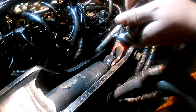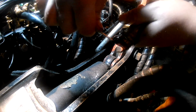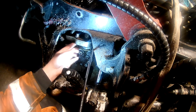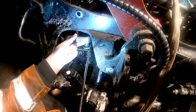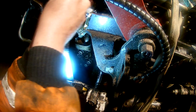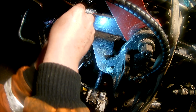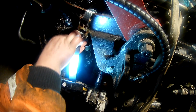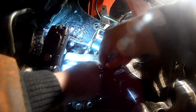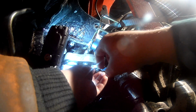Here are some of the blue seals that I replaced. These are quite expensive. The O-rings weren't that much in price. Here I hadn't cleaned well enough, so some time was spent trying to clean things up, and one of the pipes is not loosened at the other end, so I used the ratchet strap and kind of bent it up gently and removed the seal here.